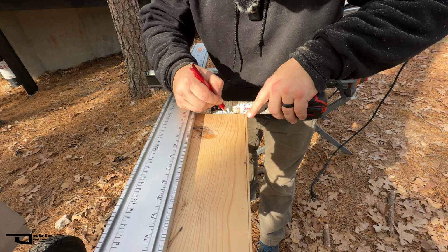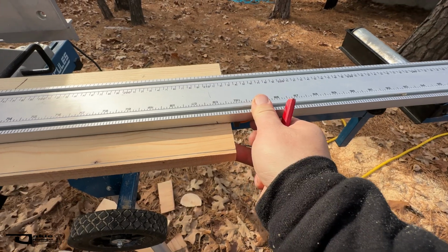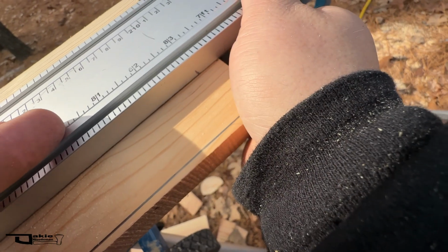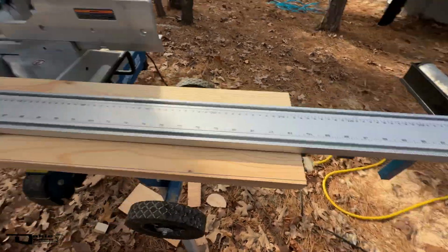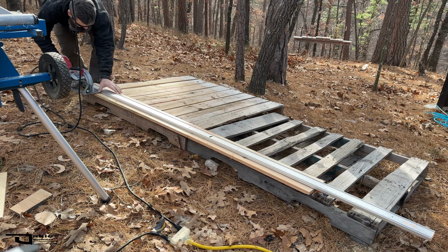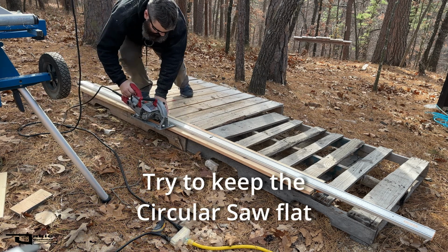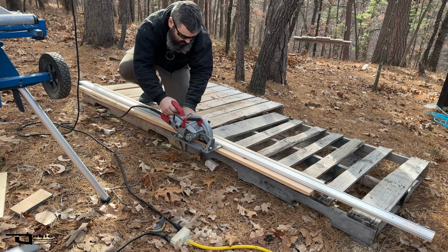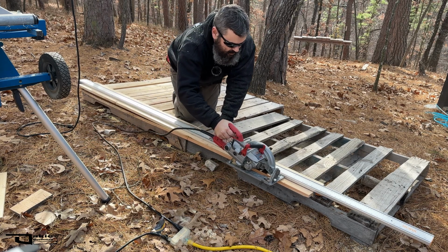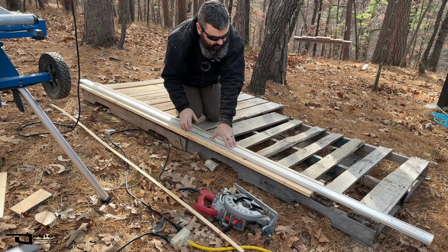Set that right on 3, and we're gonna go to 1/2 inch right there. I just want to get it closer, right? So when I butt these up, they're not gonna be glue joints. So keep that in mind. They're not glue joints. I just want them to rest together more nicely. It moved. My guide slid over on that side.